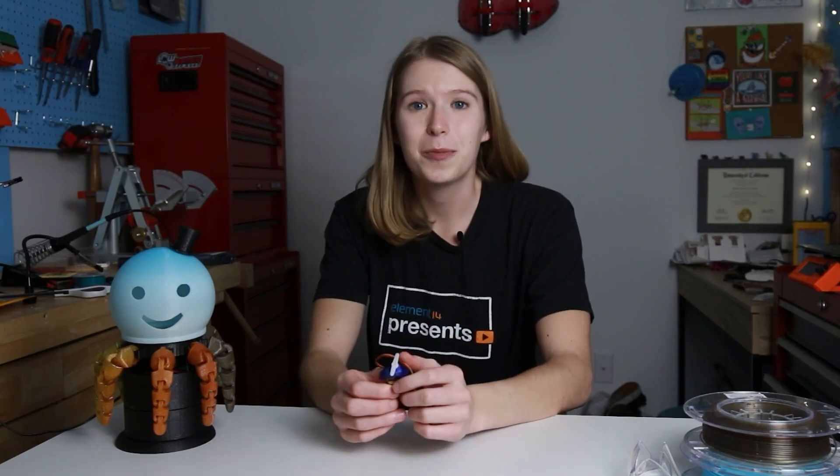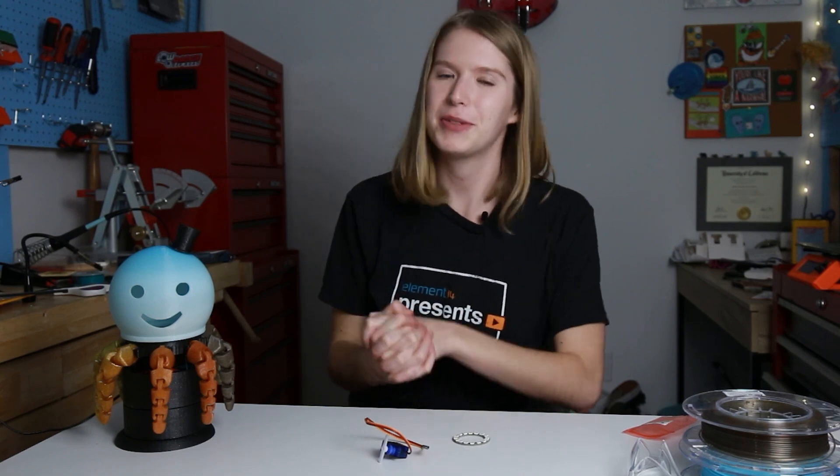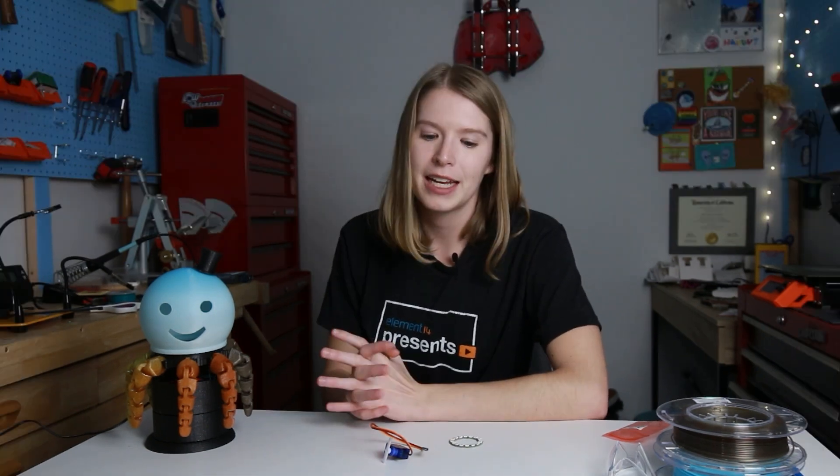I'll show the wiggling in a bit. In order to power the SG90, I wanted to incorporate a linear voltage regulator into my design — something that can show off how electronics work — to drop a 9-volt battery to 5 volts using an appropriate heatsink to power my little motor. For my second goal of making this project not too sad, I aimed to keep my code and schematic relatively simple. However, I sure tried to make it complicated, unintentionally.